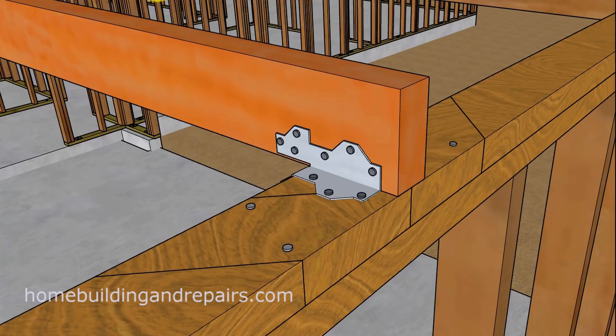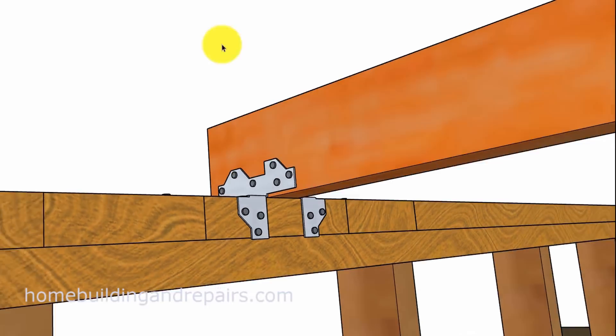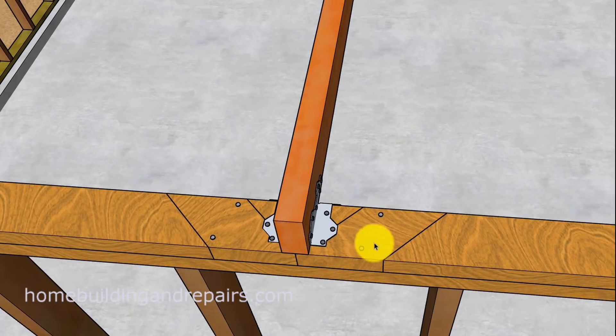Get some framing anchors and bend the tabs over the framing plates like that — just a nice connection. Now something I'm not real happy with is all of these braces here. I could just see where this wouldn't really be a strong connection. But if you could get the nails to go all the way through to the plate here, that might provide you with a nice connection.